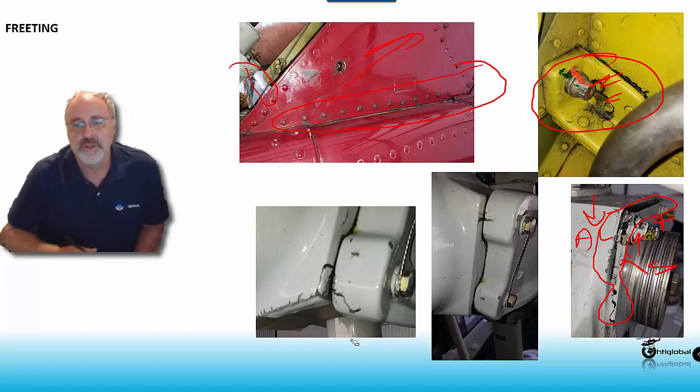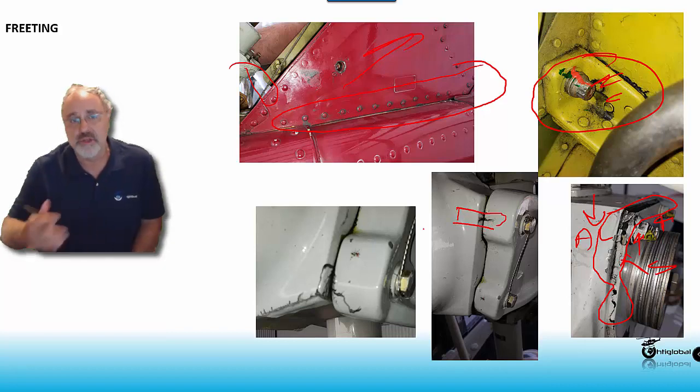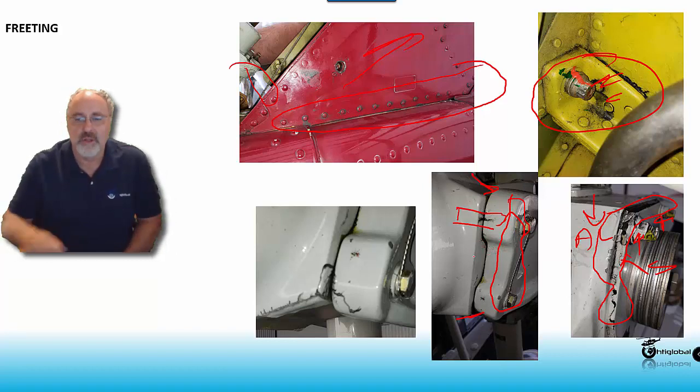Anytime you're doing this kind of installation incorrectly, you are inducing problems. Make sure you read the books. Yes, sometimes the process for installation will make the removal process very hard, and that is okay. My advice: in order to remove a pitch horn, it's going to be a very long process. You need to use wood — you're going to have to hit it with a mallet and a piece of wood. You are not going to use aluminum. You want it to be difficult to remove the pitch horn.